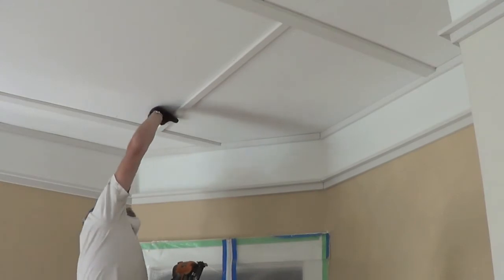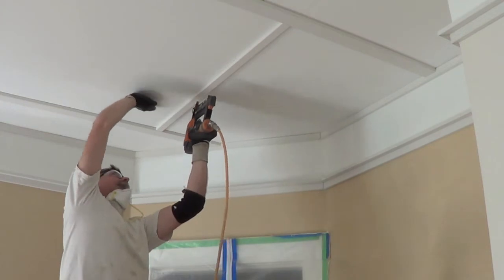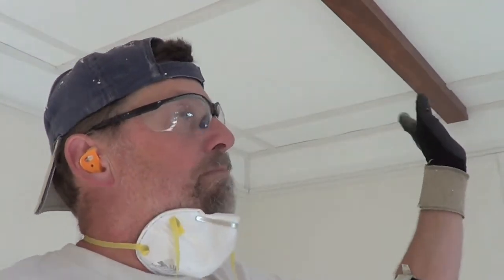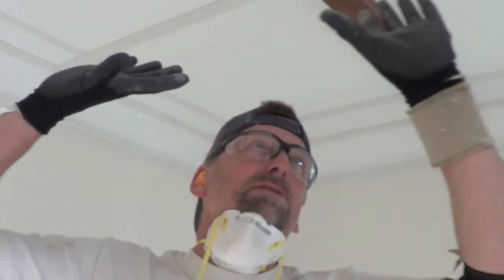Now I'm going to fill in all the gaps. On this edition of my old house, we put plywood on the ceiling with wooden box beams, and then I basically just did one-by-three common boards from the lumber store or Home Depot over all the seams. This has created a really nice sort of coffered ceiling look.